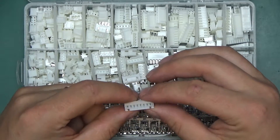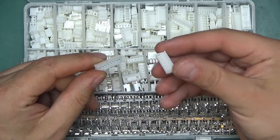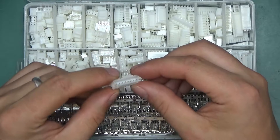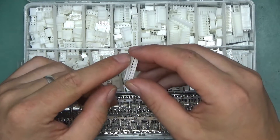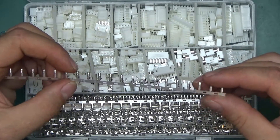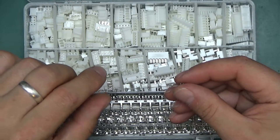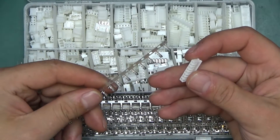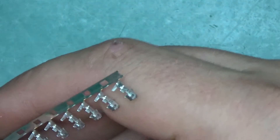In this video we will make up one connector — I'm going to choose the eight-pin because I have an eight-pin piece of wire. Each connector is made up of essentially three sets of parts: the part that goes into the printed circuit board — the socket — then the molding or former for the connector that goes on the wire, and the crimp contacts themselves, which are supplied in lengths of tape cut to fit in the box. Those are the ones we put into the crimp tool, which make the electrical connection with the wire, and then get pushed into the plastic former where they latch in place.